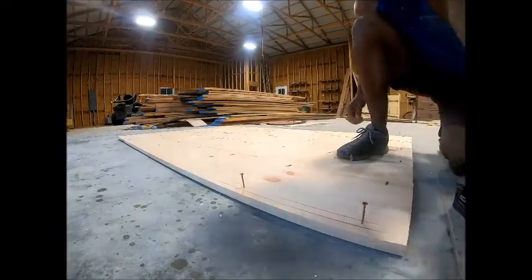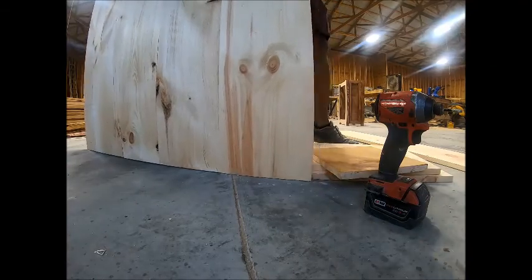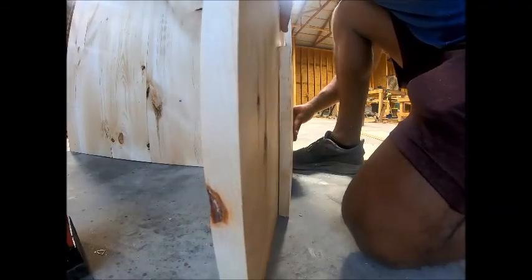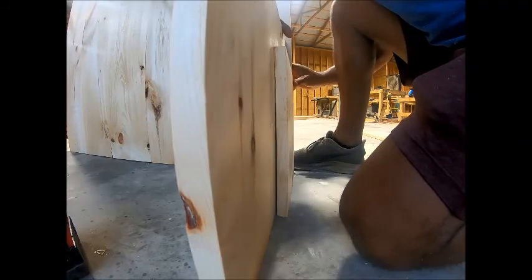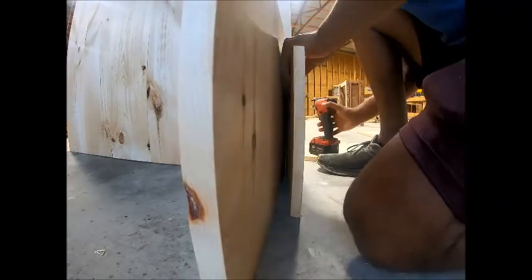Here I use two and a half inch screws. This will hold the bottom bench and the outside skirt to the bench. As you see, this is probably the trickiest part because you have to hold the back wall as you attach the two sides. All the benches I do for hall trees are about 18 inches tall — that includes the top — so this piece is something like 17 and a quarter. I just use these blocks as a reference because I know I'm going to come back and put trim on the outside later, so it has to be about three-fourths inch in.